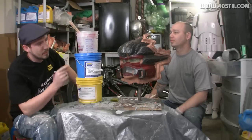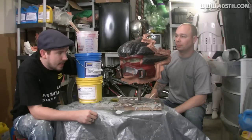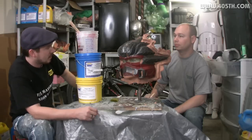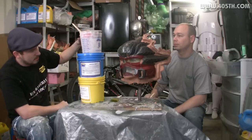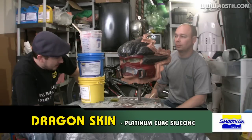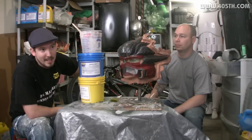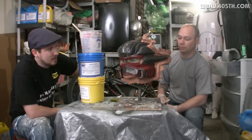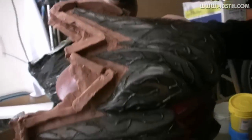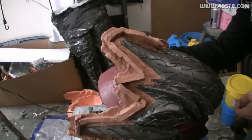Here's what we're going to be doing. We're going to be making a silicone mold on this part of the podcast. We've divided the Hayabusa helmet up into two sections — a front and a back. We're going to be molding today with Dragon Skin from Smooth-On. Dragon Skin is a platinum cure silicone, which means it's going to last a long time. They call it Dragon Skin because it's really stretchy, so it allows us to get into all these grooves without making a really complex five or six piece mold. We're just going to do a two piece.